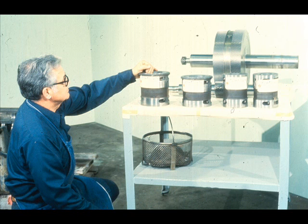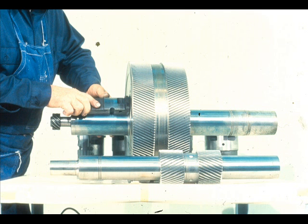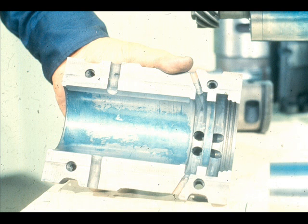You are now ready to reinstall the bearings in the gearbox. The first step in the reinstallation of the bearings is to check the contact pattern of the bearings with the shaft journals. To do this, the workman applies a light coat of Prussian blue to each of the shaft bearing journals. He then locates the correct bearing for the journal and rotates it on the shaft journal, like this, holding it firmly in contact. He repeats the procedure for each of the bearing halves, top and bottom. Inspect the contact pattern shown by the Prussian blue, like this.